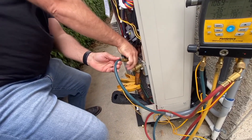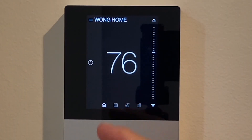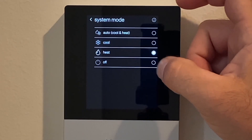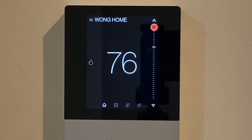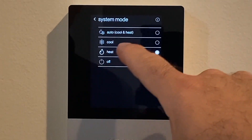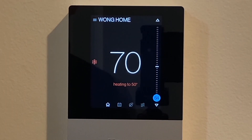Disconnect your suction line. Now that our system is done in charge mode, click stop, go back, and complete setup. What's left to do is test cooling and test heating. We already effectively tested cooling in charge mode, so let's just test heating. Run the system for 10 to 15 minutes and test heating for the customer. Once you've tested heat mode, you then test cool mode — make sure everything is driving down and working as it should.